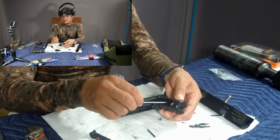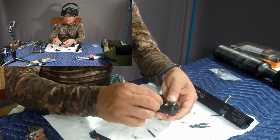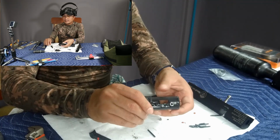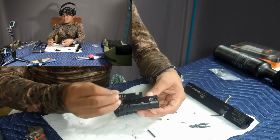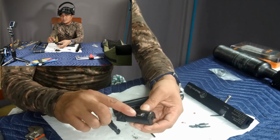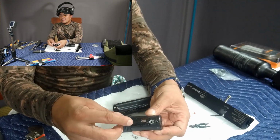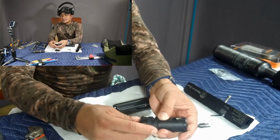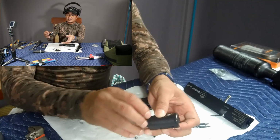So you would just grease that up some, and then just keep it in place, okay? And then just pay attention when you're putting it back that you put this all the way forward. That's what grease does, it's good for you. But you put that all the way forward, and then you just sit it there, and then when you test it, it shouldn't come all the way out even though you try and pull it, okay? So it should slide like so, okay? So that's all there is really to it for this.